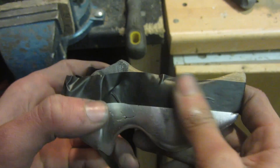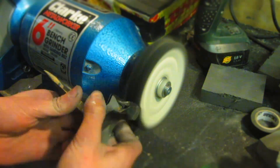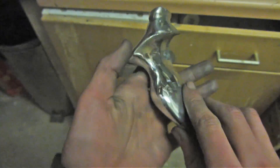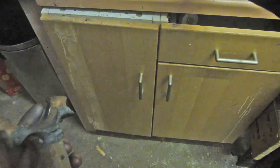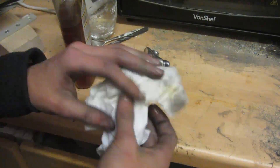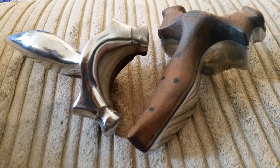I've wrapped some tape over the edges of the wooden bits so it won't dirty up any of the wood, and if it does I can always just sand it out. This is what it looks like after the buffing — incredibly shiny, and I managed to avoid getting any metal dust onto the wood. Now I'm going to take some boiled linseed oil and oil all of the wood parts. This is what the slingshots look like once finished — they look really nice, the oil has really brought out the contrast and grain in the wood, and it's also made them slightly more water resistant.